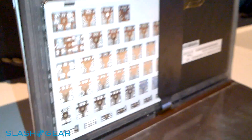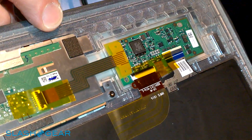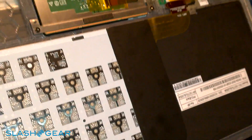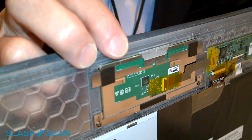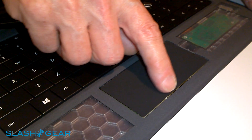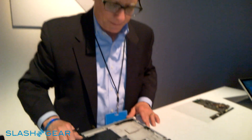If we open it up, you can see the back of the keys. There's an electronic control board with a flex cable that goes down to the mating connector that would go into the Surface device. And then our new trackpad — this is the back of the new trackpad with a mechanical switch, so it gives you good tactile feel. Plus the top of the trackpad has a glass-beaded surface to reduce friction and make it really easy to navigate. Two-finger gestures now work on this particular trackpad.